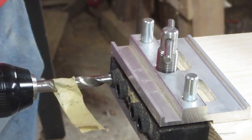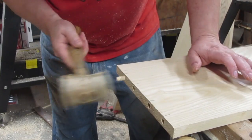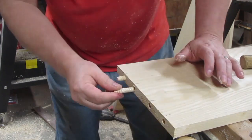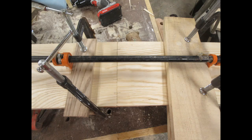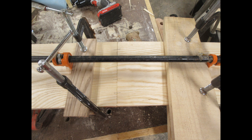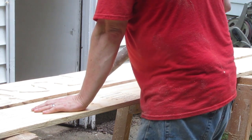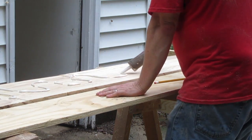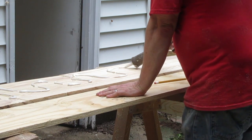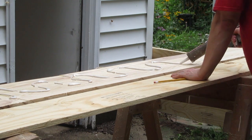For my third attempt — which is, by the way, the one that finally worked out — I decided to go with 3/8 inch dowels drilled right into the end grain of the boards. I had to get a little bit creative with my clamps. Even with the dowels, I know that an end-to-end joint like this is not very strong at all. But fortunately, in this case, what I'm making is a counter, so I'm able to back it with a piece of plywood.